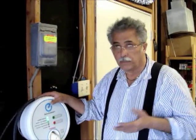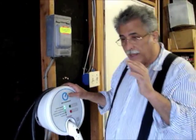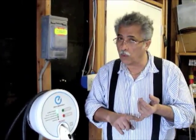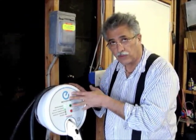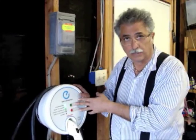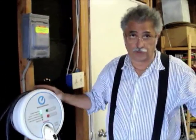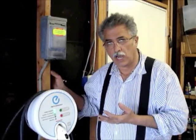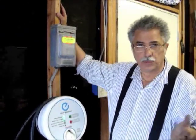This is a 40 amp service. If you have a 40 amp dryer outlet, theoretically you could plug your power station into that. What people need to remember are three fundamental concerns: proper wire size, because you do not want to overload the conductor. Large enough conductor to handle the load — in this case 40 amps, so we want at least a number eight wire. We've got a number four wire coming into it; it will handle even more than 40 amps, but it's fused at 40. And finally, you want the conductor to be physically protected and mechanically secure.